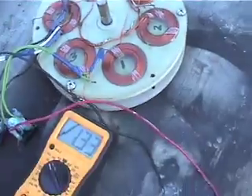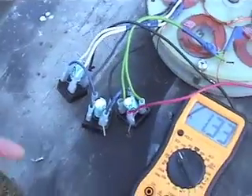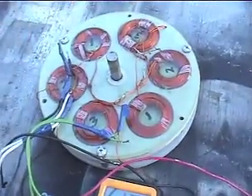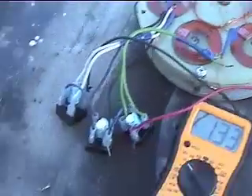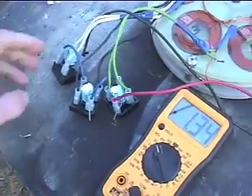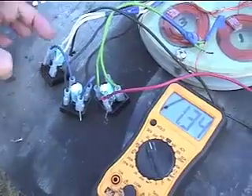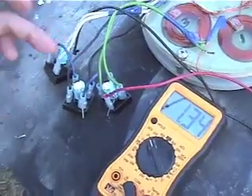I want to show you with the voltage tripler. This one isn't wired in star — each of the phases is separate, so I didn't need the extra capacitor. I just have a capacitor on each of the DC legs coming off, and then they're wired in series.